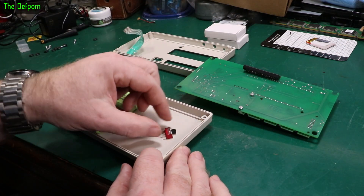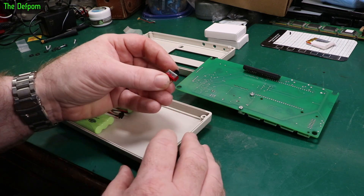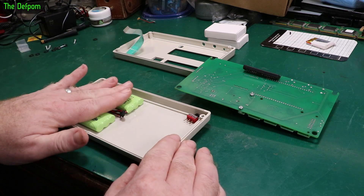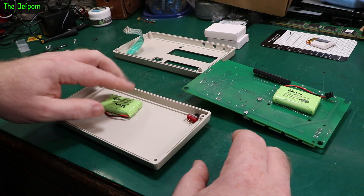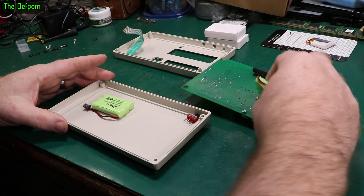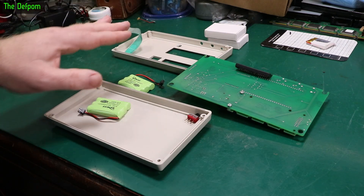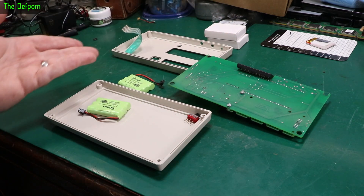So I've mounted everything on the back panel — I can cut a hole in the casing here and attach the switch. Attaching it will be tricky; I don't have any with screw terminals so I'll have to basically glue it in. There's not much stress on these switches when they're in place, so gluing should be alright. The battery placement is quite critical — I need to make sure I don't get pierced by pins that stick through the board. I'll place them on the board in the position I want, use double-sided tape, then place the cover on so it sticks in the right place. I'm going to cut the trace from the input power so it goes directly to the batteries — even if it's turned off it will charge the batteries up. The switch will then break the circuit between the charge circuit and the normal DC, so when the switch is turned on it will power the unit. You could actually charge it and power it at the same time.